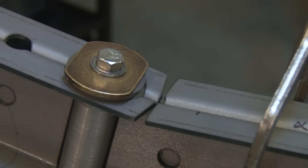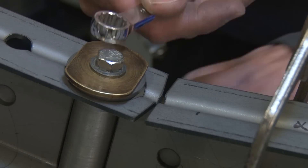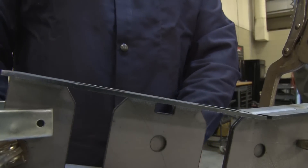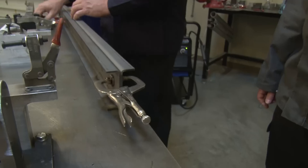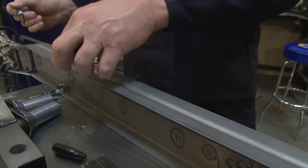So tell me more about the materials that you're working with here. It is actually mild steel. NASCAR won't let us use chrome moly, so everybody uses the stamped pieces. There are two pieces and they are put together in this jig and we square everything up so we can begin the welding process after everything's squared up.